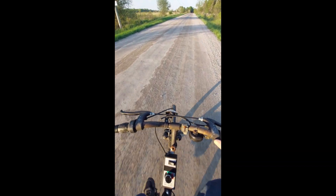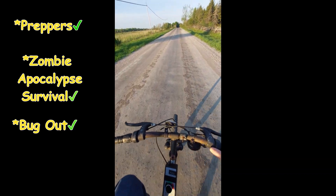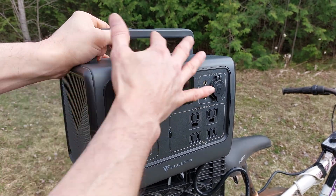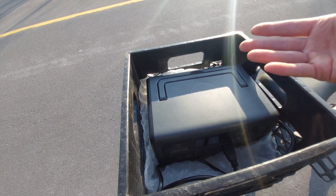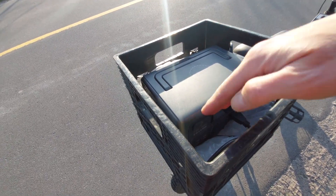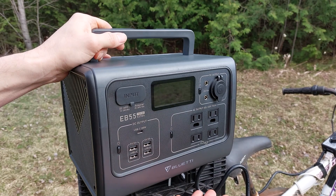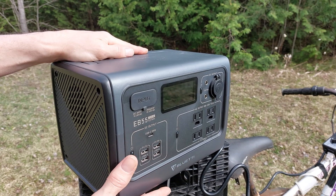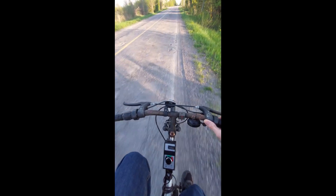I'm using the power station for now — this is an experiment. Everything on the channel is experimental; I'm showing that you can use different kinds of motors. I have a power station and I was wondering if I could build an e-bike around it. We're limited to what we can do with it: there's only a 10 amp 12 volt output, so the only real output is from the 120 volt inverter, which provides about 700 watts. The internal lithium iron phosphate battery is 22.4 volts — a little low on its own — which is why I came up with this chainsaw-powered bike idea.